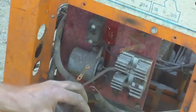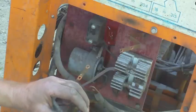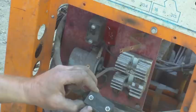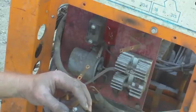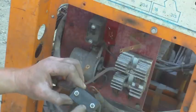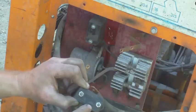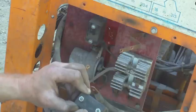The other thing you need to know is the working voltage, which would have been printed here but is not present. Also over here is MFD - that stands for microfarads, that's the unit of capacitance that would tell us what this capacitor is in microfarads, but that number is also missing. There's also a placard here that says amps - I guess that's the maximum current that could flow through the capacitor, which you don't usually see on most capacitors. Then there's KC which stands for kilocycles, an old way of saying kilohertz - one kilohertz is 1,000 cycles - so this tells you the frequency range this capacitor is supposed to operate at.